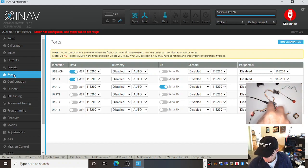So that can be overlaid on the video signal, which is interesting in itself. I'm probably digressing a little bit, but remember I talked about ACMA, Australian Communications and Media Authority, the other day? Well, the class license for 5.8 gigahertz is 25 milliwatts. I said 25 piddly-watts because it'll take you 100 meters on a good day, probably not even that. But because we're overlaying telemetry on the video signal, the ACMA do allow up to 1 watt for telemetry data, to output your video as telemetry.